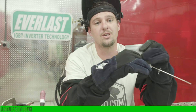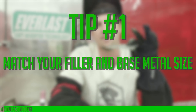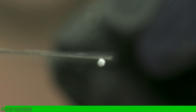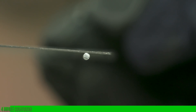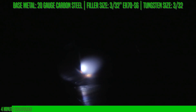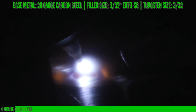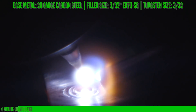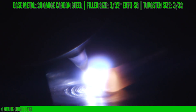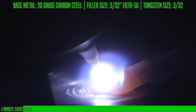Four minutes on the clock, so let's get into it. Tip number one is using the correct filler size with the base metal. A lot of welders I see are always using thicker filler wire than the base metal. I'm going to show you what happens when you use thicker filler wire on thinner base metal. All right, so first we're going to just establish our puddle. All right, we got our puddle established. See, I can't even melt the filler wire — I'm going to try, but see how it's balling up and I lose my puddle.